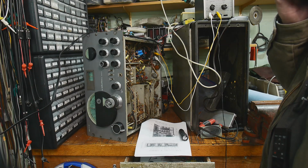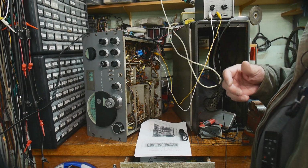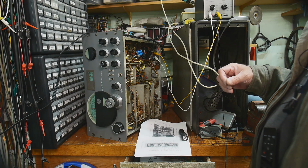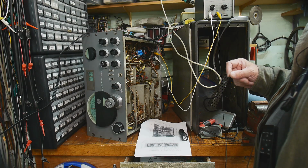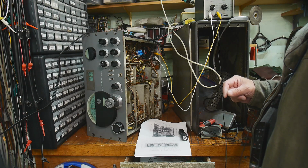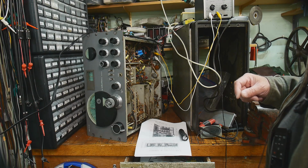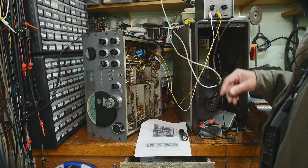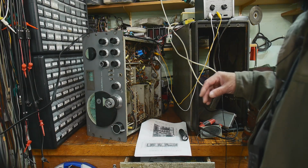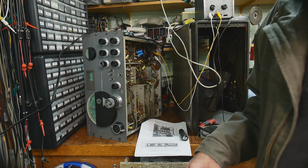And when I used a function generator, I went through all the bands up to 100 megahertz, and every single band can receive, but they're very, very low. So I think what I want to do is tune it up a bit. There are still a couple capacitors that need to be replaced, and maybe I should do that first, but I am an anxious person, so I can always do that later and adjust it again. I don't think they're too far out, probably. Well, I don't think they're critical. I think they'll add noise, but I don't think it'll add any problems with the tuning.